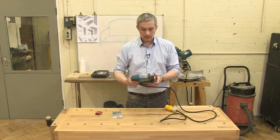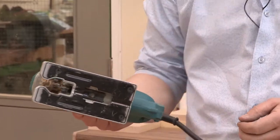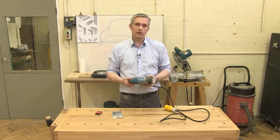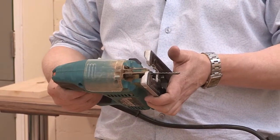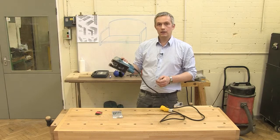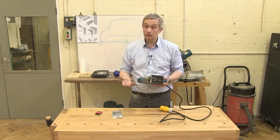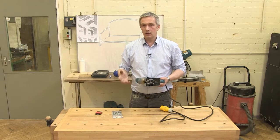Another really useful tool for the home woodworker or small craftsperson is an electric jigsaw. It's worth buying a good one from a well-known brand — the quality of cut you get with very cheap jigsaws from a DIY outlet tends to be quite poor and frustrating. A jigsaw cuts freehand curves for the most part in thin sheet material. With the right blades you can cut perspex, various man-made boards, thin timber, or even metal — there's a hacksaw-type blade for cutting thin sheet aluminium or steel. It's very noisy and quite slow for metal, but it will do it.